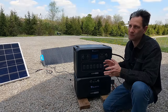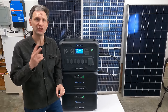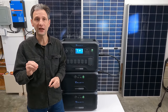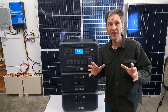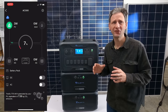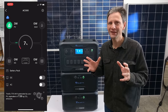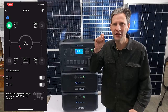The main unit can handle up to 2,400 watts of solar input across two separate MPPT controllers. I pushed one input well over 1,000 watts using a small 1,200-watt array of used panels lying on the ground, and used those panels to charge the batteries and run my dehumidifier every day for weeks with no issues. One notable thing about the charge controller on this unit: it is very sensitive. As the sun was setting, I tracked the minimum input all the way down to just 3 watts. Other inverters I've tested cut out at 20 to 30 watts. You're not getting much energy at 3 watts, but the engineer in me really values optimizing to squeeze out every last bit of available resource.